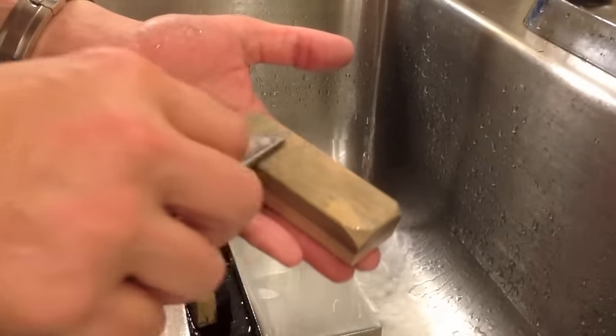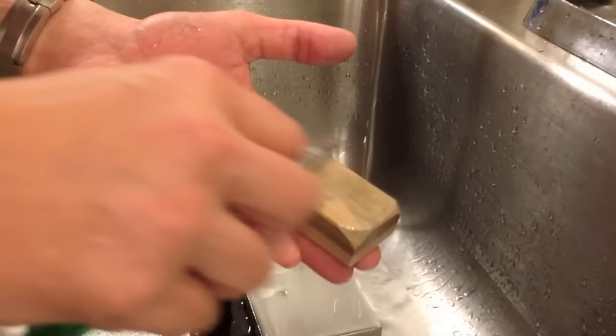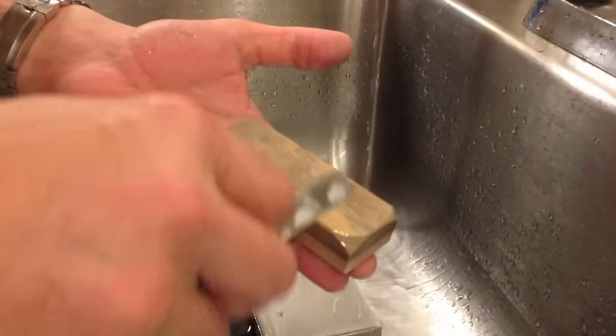I've never seen one of these hybrids auto-slurry, so you can pretty much forget about that. Auto-slurry is when the stone kicks up fresh particles as you're going along — some stones are prone to it, but not this one.